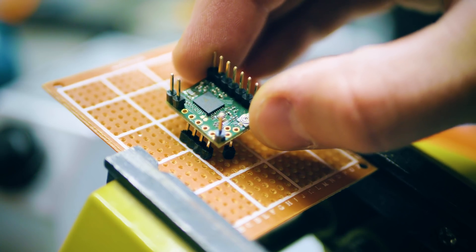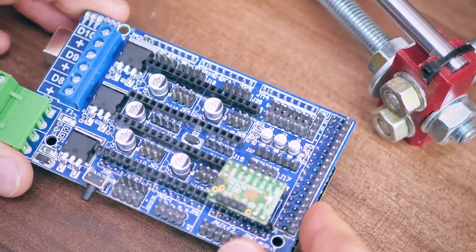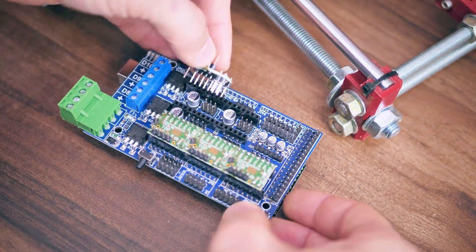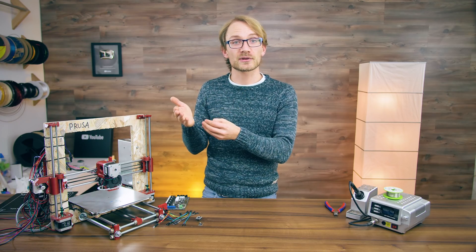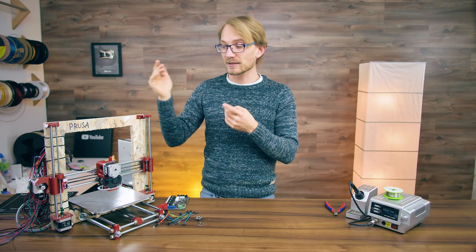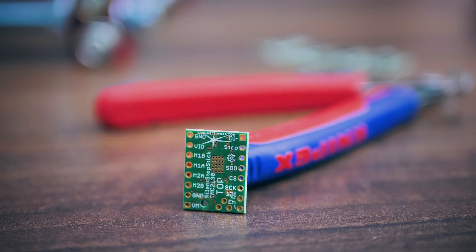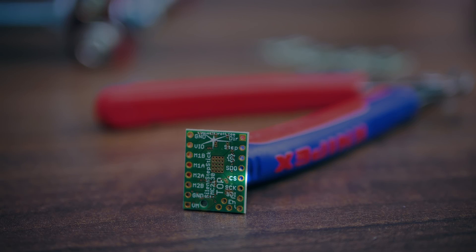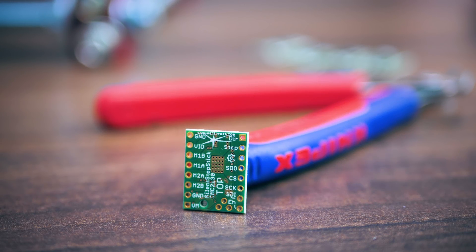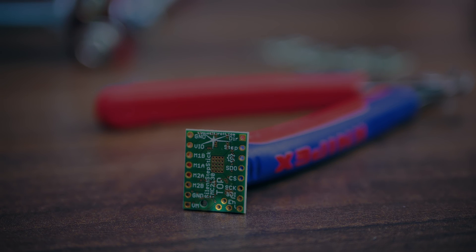Next up, we're going to wire these up. Replace your stock driver boards with the silent stepsticks, making sure you've got the stepper motor outputs on the board facing the motor connector or the labels on your mainboard. Now we can hook up the communication ports. The SPI bus we're using here is a master-subscriber bus, which means you have one device acting as a bus master and all others as subscribers. In our case the master is the ATmega chip used on the Arduino, and all our TMC2130 chips are subscribers. We have a few pins here: serial clock, serial data out, and serial data in. Each of these signals gets wired in parallel from all of your drivers, so grab some jumper wires and breadboard and hook them all up. The 4th pin is the chip select pin, which the master uses to tell each subscriber which one it's talking to at any given time, and each of these is routed to its own pin on your printer's motherboard - just like the diagnostics pin, which the drivers use to signal step loss back to the controller.